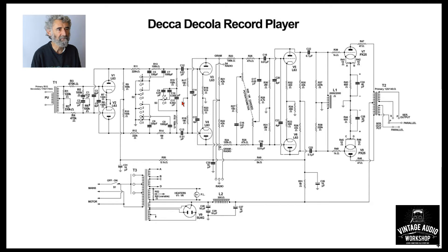We have balanced circuitry all the way through, with switched compensation. There appears to be a fault in this circuit: this resistor here is 100k and this one is a megohm — I checked the parts list and it says the same. I'm fairly confident the megohm is wrong and should be 100k, because this is otherwise balanced circuitry from beginning to end. The switched tone control introduces varying degrees of capacitance between the two grids, so it is a balanced control acting equally on both halves, introducing greater treble cut — with a 0.005µF in series with 100k.